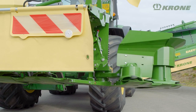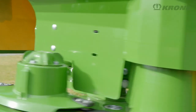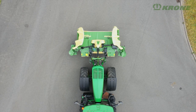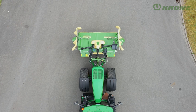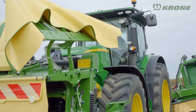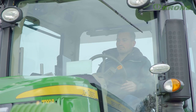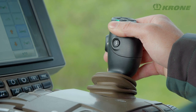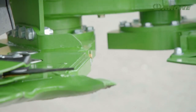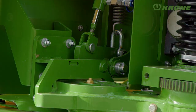The landmark feature is the foldable cutter bar — a first-time novelty on a disc mower. A hydraulic slewing gearbox swings the outboard discs between the mower and the tractor. The mechanism is linked to the end curtains via sequence control and is operated via a double-acting spool. All functions are controlled conveniently from the tractor seat, so there is no need to leave the cab.